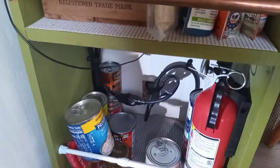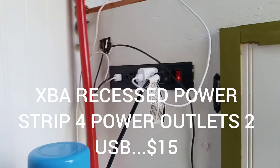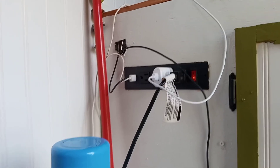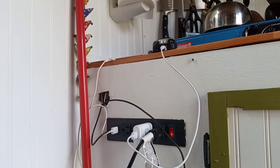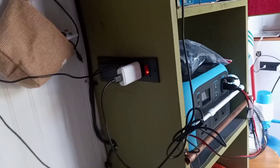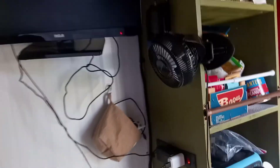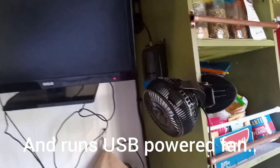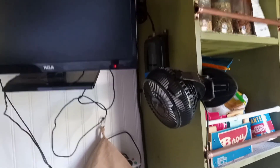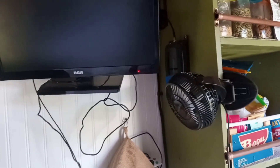We'll show you where those run. There's the cord right there running up here, connected up here to the first power outlet. Got about four 110 outlets and two USBs — that's for the kitchen, so you can have something there on the kitchen counter, or back over here. This is the other one that also is charging devices, fan, or our TV plugs in there with 110. And behind the fan is our high boost signal booster — it also needs 110. Both of those can run off of 12 volt.